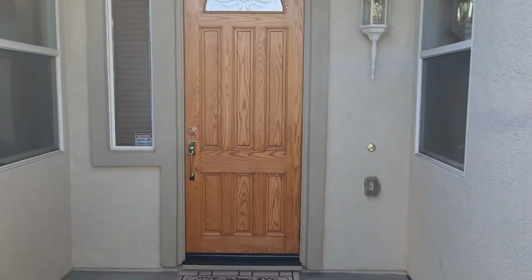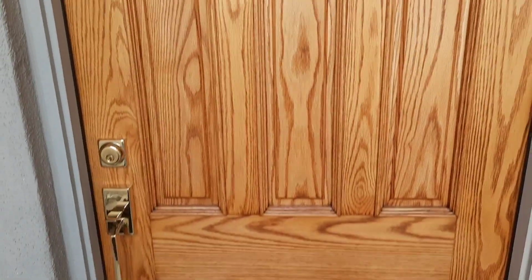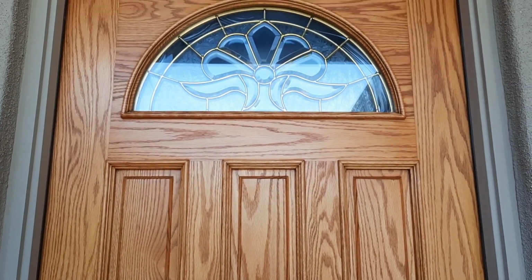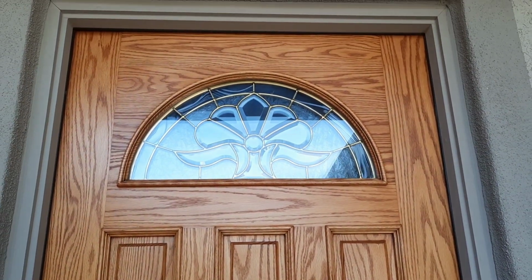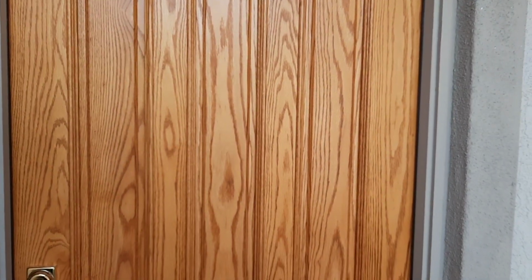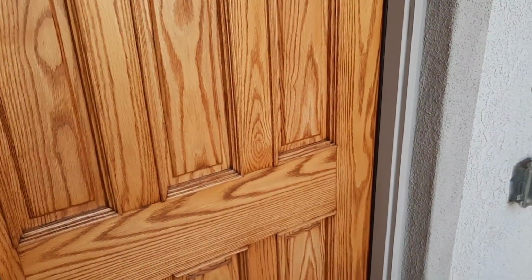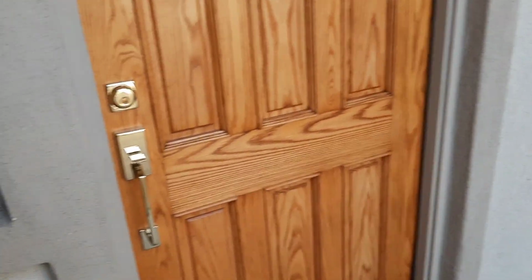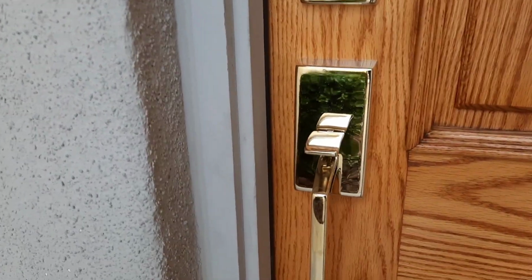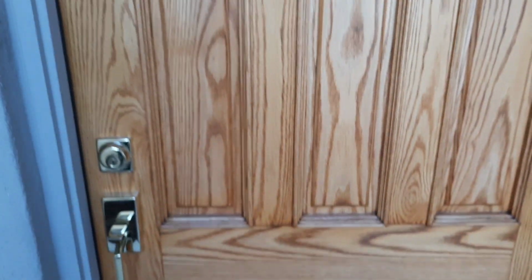I'm very happy to say our door was successfully mounted. The threshold was painted. Everything looks fantastic. The color's great. I do advise having some help mounting the door. This is over 200 pounds and it took 3 of us. You want to make sure when you're angling the door back it's level and flush. Otherwise, if you put too much weight on one of the hinges, you might break one out of the door frame. So our hardware looks great. It buffed out really nicely. And the color is amazing.